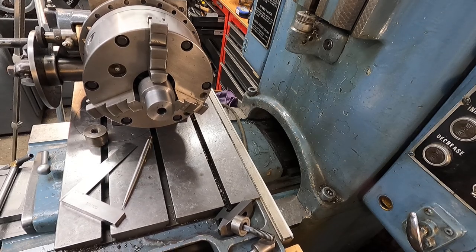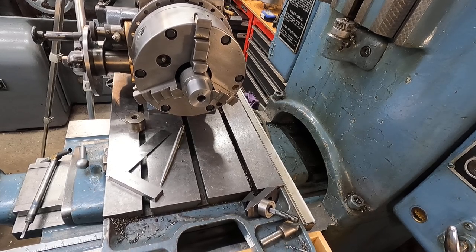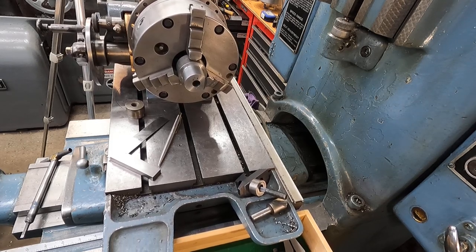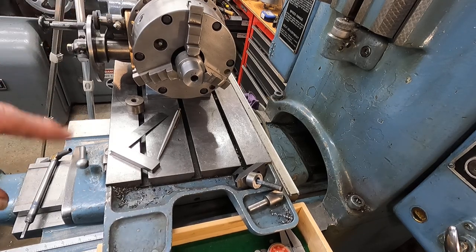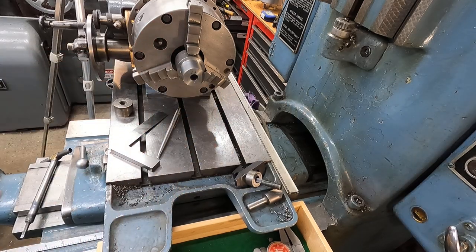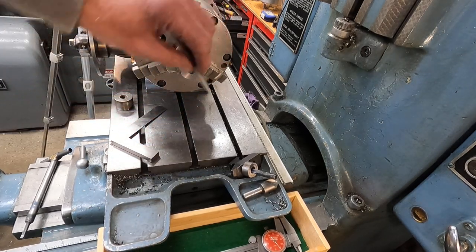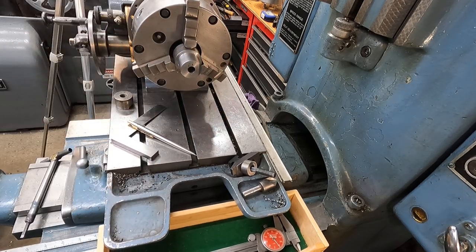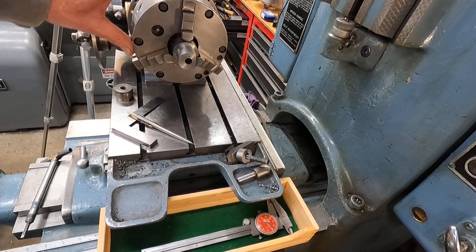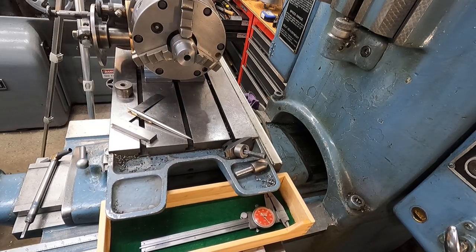The screws on the Moore jig bore are 100 thousandths per turn, so it takes a while. All right. Now, I've got the digital readout set at the right distance to cut that. So I'll just get that over there, and I'll get it at the right place this way. Then we'll just have to feed it this way. I'm doing it on this side because this dividing head, the chuck screws on, so the forces will be on the tightening end of it.